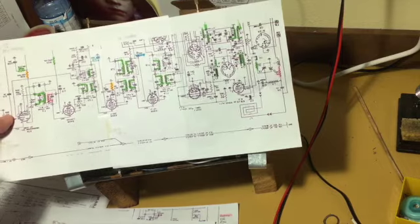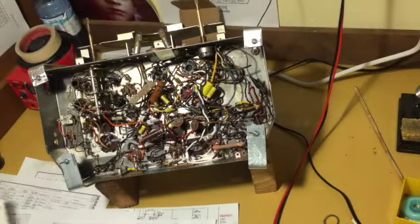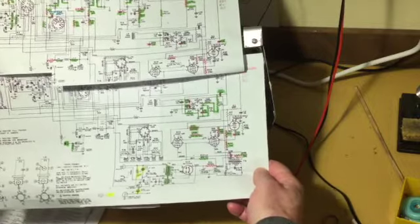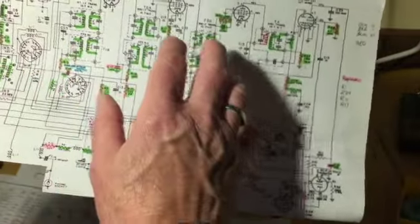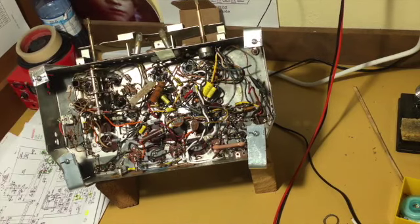This is the tally for replaced parts — tested and replaced. All the green marks are things that tested good. These two sheets make up the whole thing. Every place where you see a pink line and a green line, those were all replaced — just throughout the radio. Including down here, which is marked on this copy. That's how you progress.